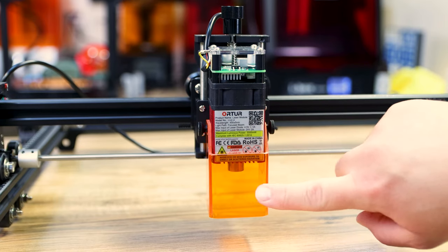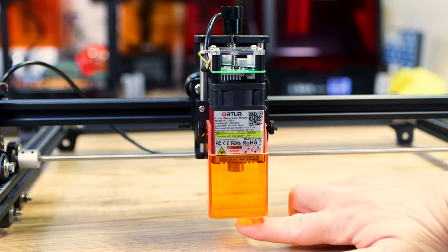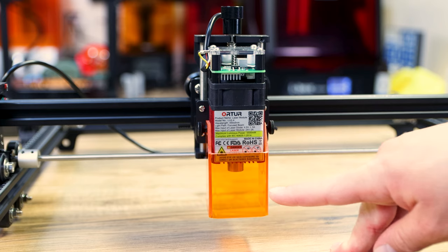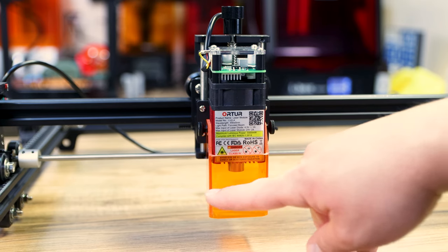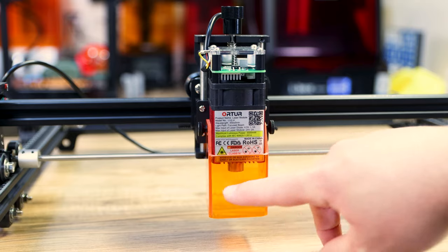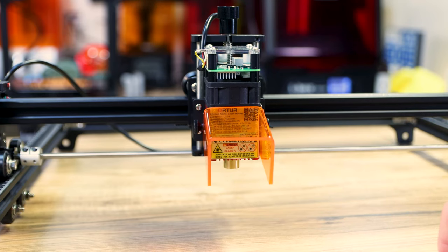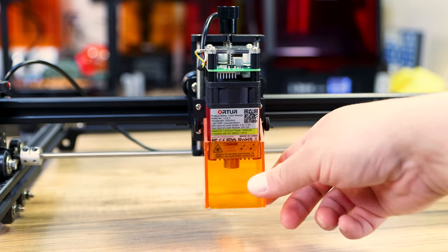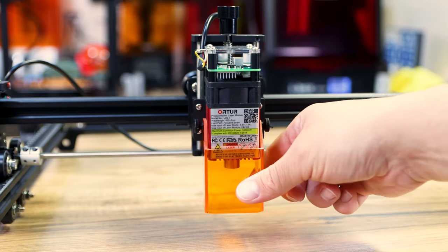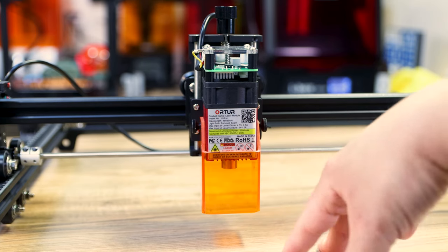Another cool thing is this laser safety shield right here. It's down so you don't get exposed to most of the beam. A lot of times your material will actually sit up close to it, so there's much less chance of accidentally seeing the beam if you don't have an enclosure. I always burn with mine in an enclosure, but if you don't, at least you have this protecting you. The shield loosens and flips up if you need it to, and it helps with focal distance. Once your material is set, slide it back down and lock it in tight.